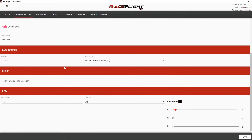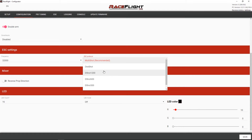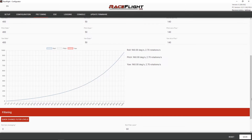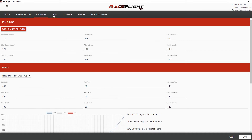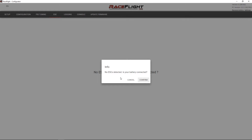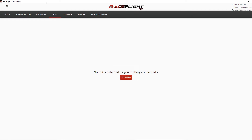You've got your radio stuff, ESC protocols. I'm actually using OneShot on this, so we'll switch there. There's a checkbox to reverse prop direction, so that's fun — I know a lot of people are running that now. LEDs, some PID tuning windows. Neat. It actually does communicate directly with the ESCs. Interesting. My battery is not connected, but we'll get back to all this in a little bit.